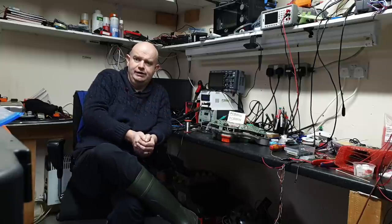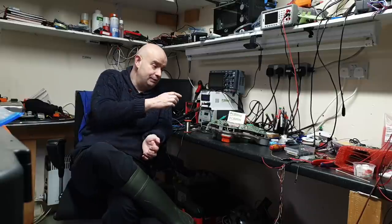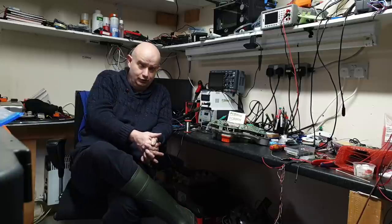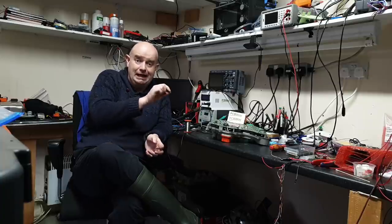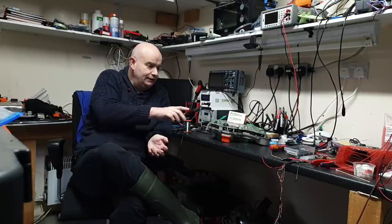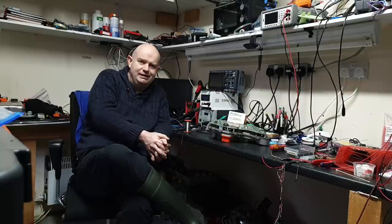So we had all those pins reverse engineered, and I went away and designed a little PCB that would take the place of the package, which I think is a 177 pin package for the TMS microcontroller. I had that made in normal FR4 material, using just ordinary pads around the edge of the board. It was fairly thin. I got it down to 1 millimeter thick, and with a few little demo boards that I had here that let me practice soldering and things like that, it just didn't work out in that material.